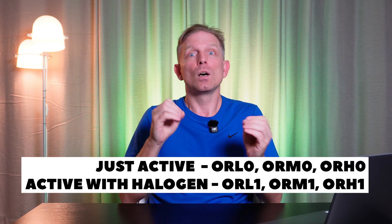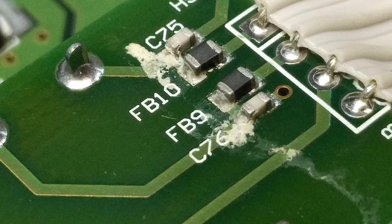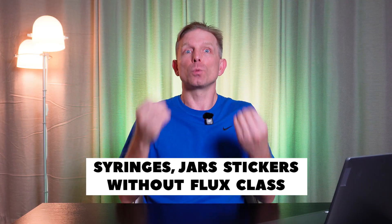The flux activity classes are: L0 or L1, M0 or M1, or H0 or H1. So if you use water-soluble flux, it needs to be cleaned with water. If you try to clean it with alcohol IPA, white or gray oxides can form. And remember the first rule: flux always remains under SMD components — meaning conductivity and current leakage from the remaining flux residues are guaranteed. Another problem is that flux manufacturers often don't indicate the flux class, which leads to problems. You think you bought a good flux, but because of missing information you have doomed yourself to random results.